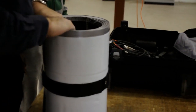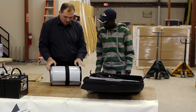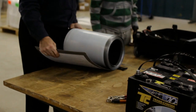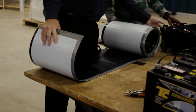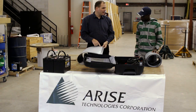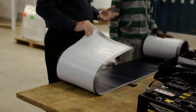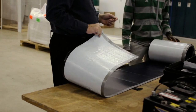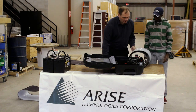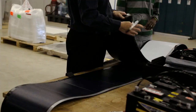Inside the case is one solar panel — this is a 128-watt solar panel. You can see it's flexible, and when I open it up I can roll it out. This is what we would get installed on the roof of the school. The back has an adhesive already attached, so I peel the white backing off and stick it down right onto the roof, or onto a piece of plywood that gets bolted onto the roof. When I unroll it, you can see this end has the connectors that attach to the cables.